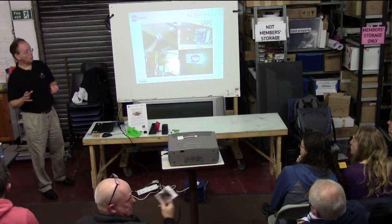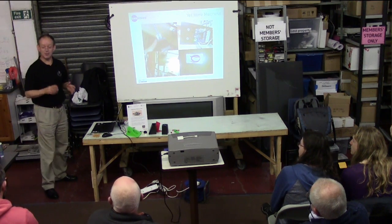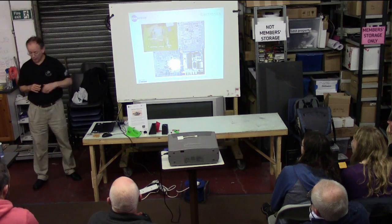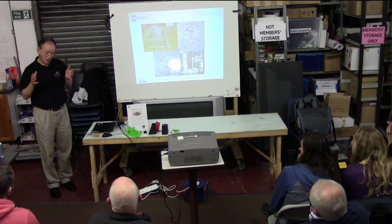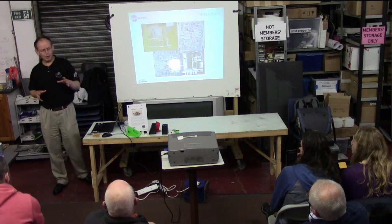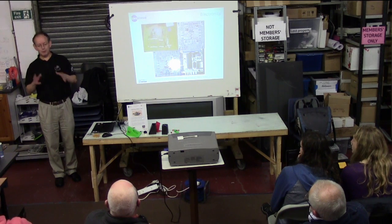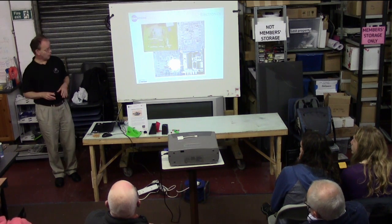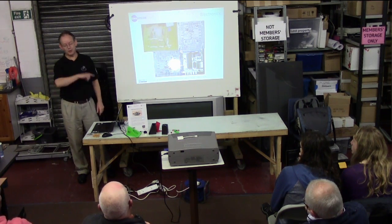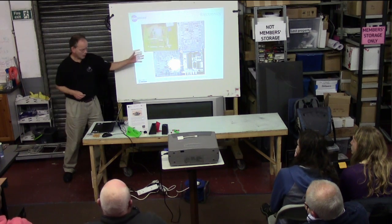If you've done one before, it'll probably take you around 8 hours. If you haven't done one before, it's about 24 hours, because you're worried about getting the right fit and doing it the right way. For this particular one, they have their own circuit board — one of their guys is an electronics designer, he designed it — and you have to solder it up yourself. That's the hardest part. This is not a beginner's soldering job; it's all through-hole, but if you've never used a soldering iron before, do one or two things first before you try this one. It's incredibly well documented — there's an image for every component showing where it goes on the board, with a big red circle around it. If you follow it step by step, it's very hard to get wrong, but there's quite a lot of it.